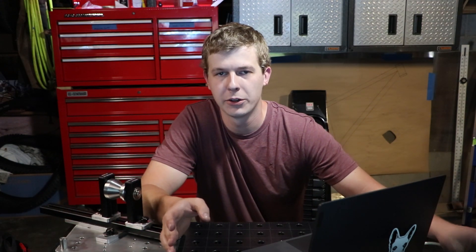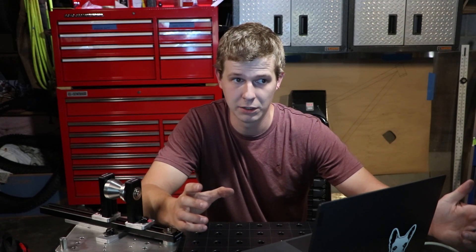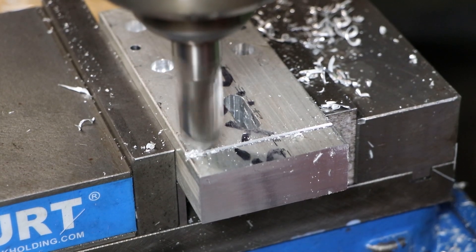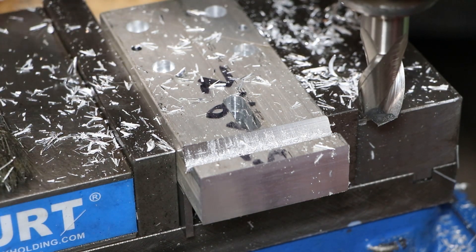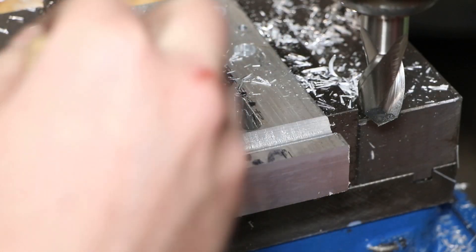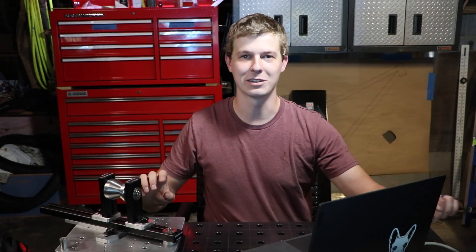The rear axle holder is another pretty straightforward assembly — basically just a larger slide plate with some 3x3 inch extrusion on top for the tower. But the axle holder arm gets a little tricky, mainly because of the V-slot that we need to mill into it. It's tricky because we need to get the location, the centerline of that slot, and the depth right at the same time. I'm going to go ahead and tell you I probably did it the wrong way — maybe some of the real machinists out there can leave a comment on how it should be done.